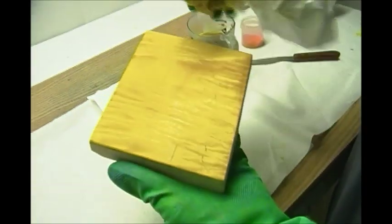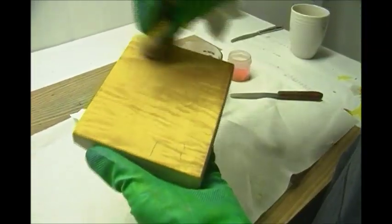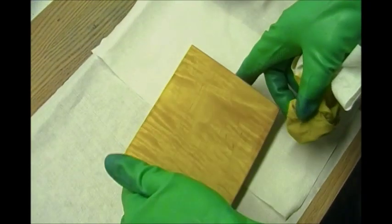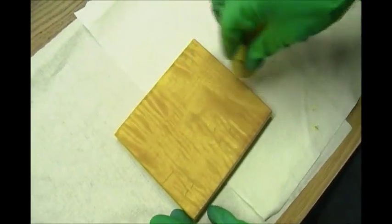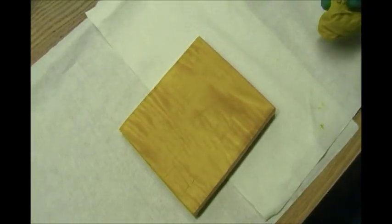And when you're working with dyes, I'm using water dyes because it's nice to have the penetration with the water, because that's what the wood naturally takes in. So it works so much better, and you can make some pretty nice, rich, vibrant colors. If you check out some of our other videos where we made the green and the purple, you can see that you can achieve some pretty decent color with the water dyes. So I'm going to let this dry out, and then we'll come back for the rest of the process. I'll probably have it sanded out, so we'll be right back.